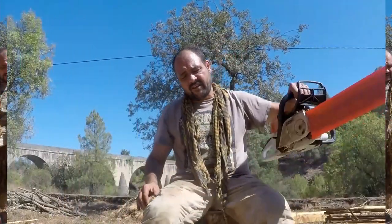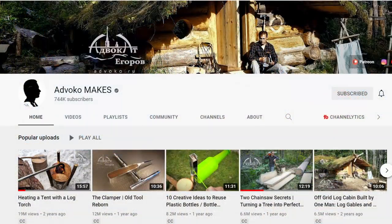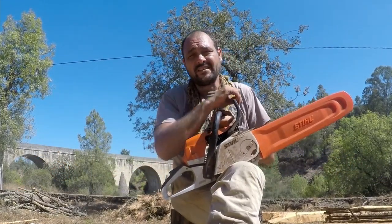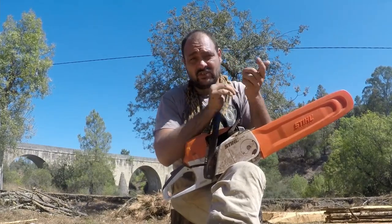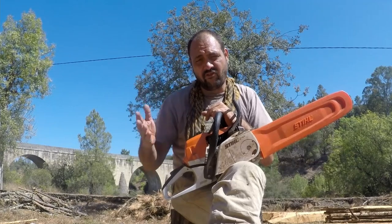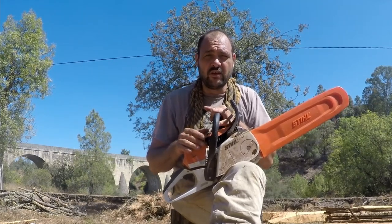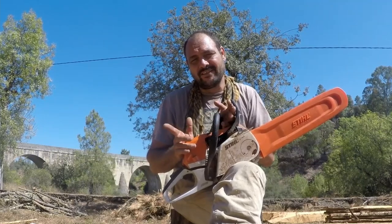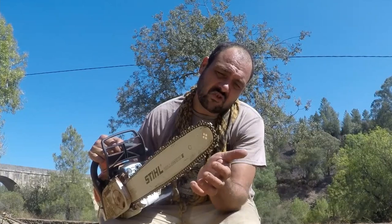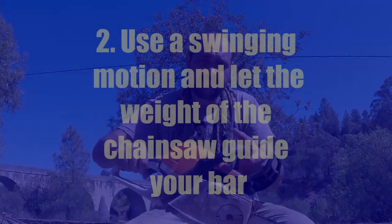Here are some do's and don'ts of freehand chainsaw milling to protect your equipment, and a bit about technique because I've had to change my technique. I learned freehand chainsaw milling from a channel called Advoko Makes — he goes through some tips on freehand milling. He has an Alaskan mill, a jig he made himself, and he tried all three methods. He said freehand was two to three times faster and two to three times more economical on fuel. When you're freehand milling, you want to bring the bottom up and cut with around two to four teeth at the bottom end of your bar, going back and forward.